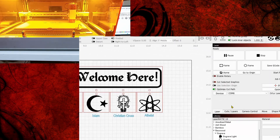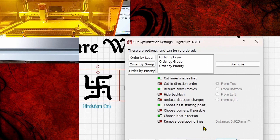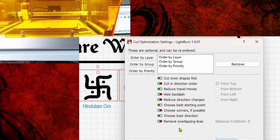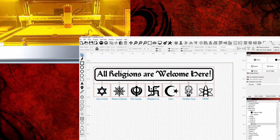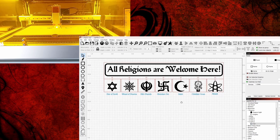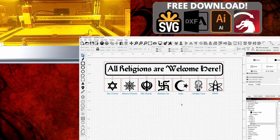LightBurn will not cut two of these if you have your optimization settings right. Come over to the Laser tab and click on 'Optimization Settings.' In here you'll see 'Cut inner shapes first' — you should have this ticked on, because we want to cut the little circles out first. Down at the bottom you'll see 'Remove overlapping lines' — this one may not be ticked on, so go ahead and tick it on, make it green, and now you can be sure it's not going to cut double lines. That just makes the job a little faster.